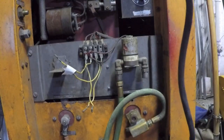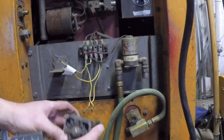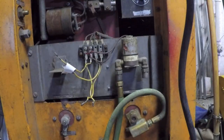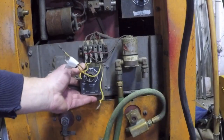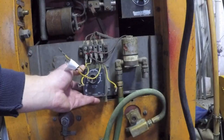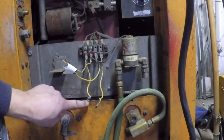Okay, here's the current holdup and the next pain in the butt. This is the original electromechanical module that went in here like so. And I just went to mount the solid state module, the upgraded module, in, and if I mount it right where the current screws are, the bottom edge of the PC board will be overlapping this.